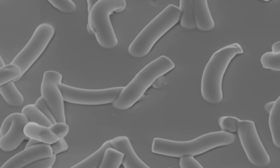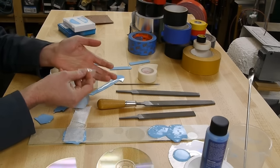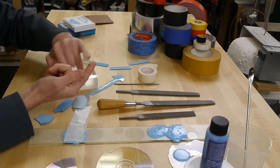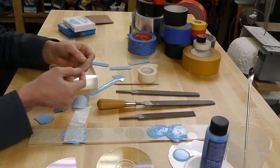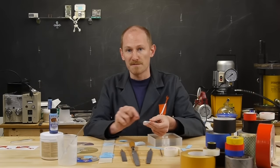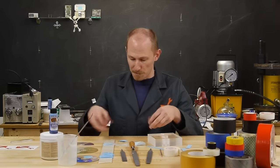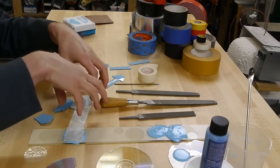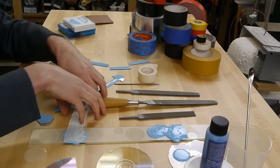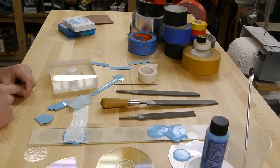The other problem is that the pillars have a really high aspect ratio - they're like wet noodles just falling over because they're too long. The membrane is 10 or 20 microns thick, but that's still way too thick relative to the 5-micron pillar diameter, so the pillar just folds over. We want the pillars to be fairly stiff so that when we put it down onto the surface, they have enough rigidity that their ends touch the surface and make good contact. If they're all just flopping around, the whole gecko mechanism doesn't work.